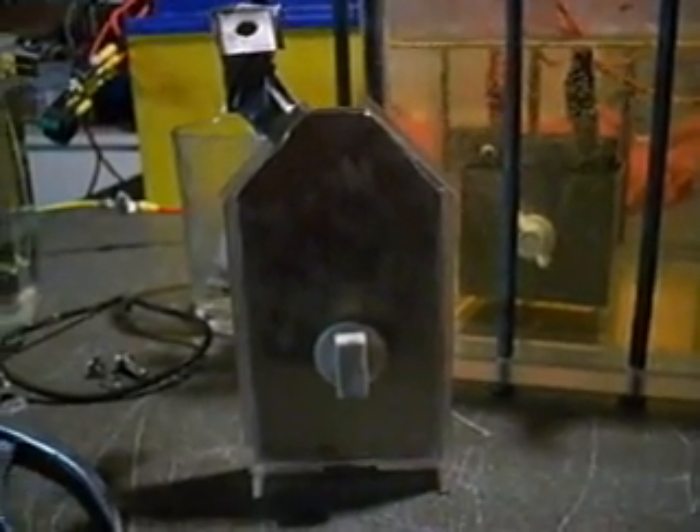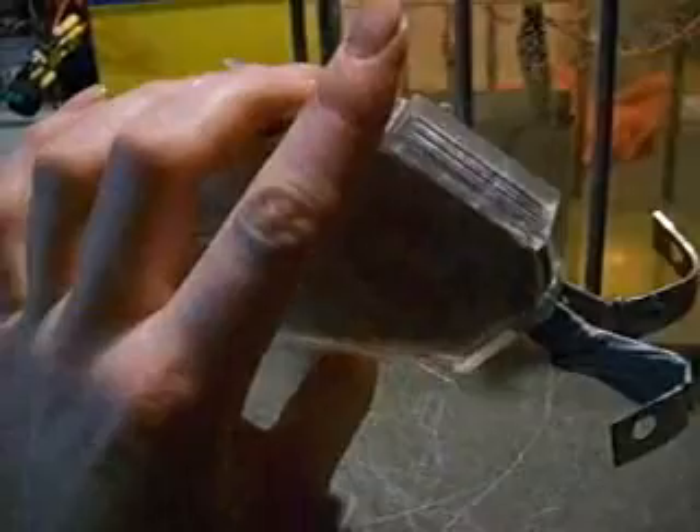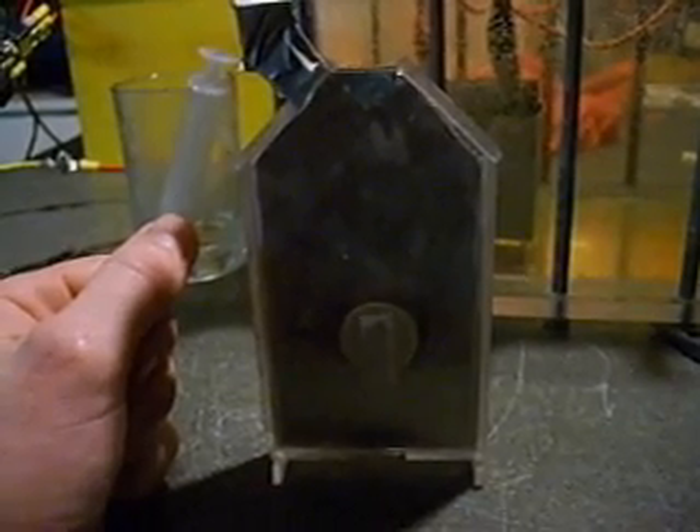So there it is out of the water. I think I might call this the 'home cell' — this is Hydrogen at Home and it does look a bit like a house with a chimney, so that'll do. It is just a test cell. Basically it's one positive and one negative with three neutrals in between, and it's completely covered on all sides with plastic except for a small opening at the top and bottom. It's all glued together with two-part Araldite — the glue pushes in between the plates to keep them properly separated. I'm not keen on glue though, as this Araldite will eventually break down in the water and the whole thing will just fall apart. Apparently there are better glues such as a marine glue, but even then I'm not that keen on the idea.